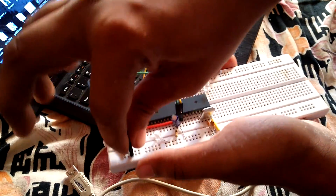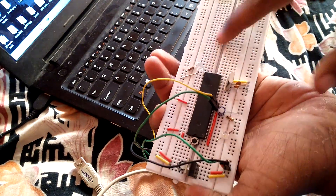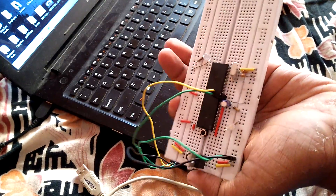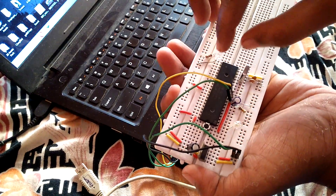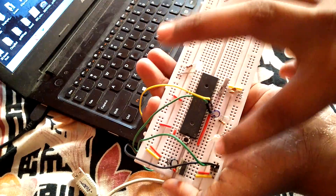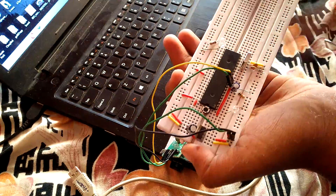You don't need to put up a battery here because the breadboard is going to have power supply from the USB to UART itself. Don't get confused with the LEDs and the setup here, as almost all of the setup is the same. The only connection you have to make for programming is the USB to UART to your breadboard.